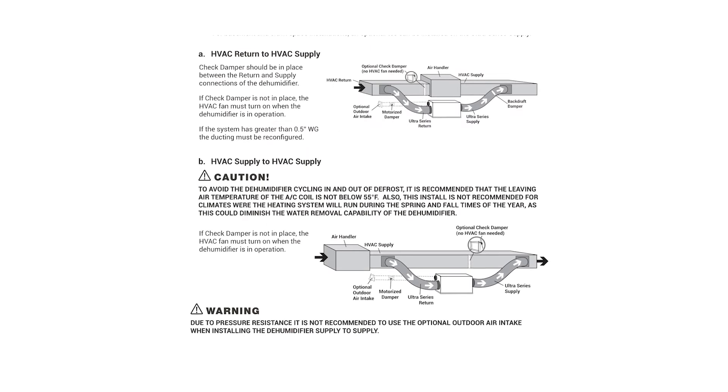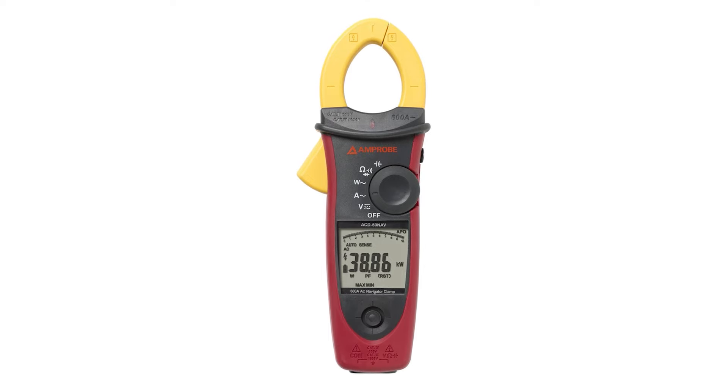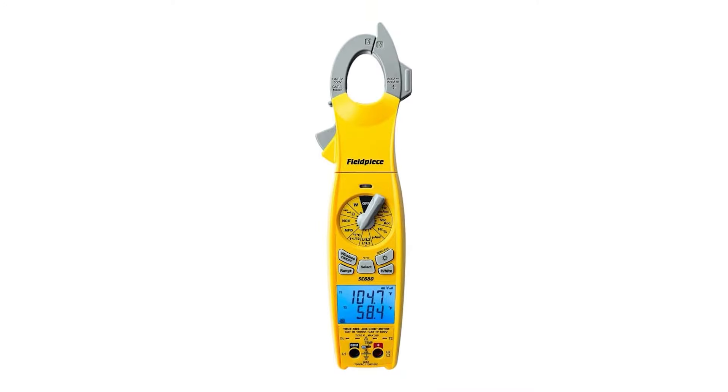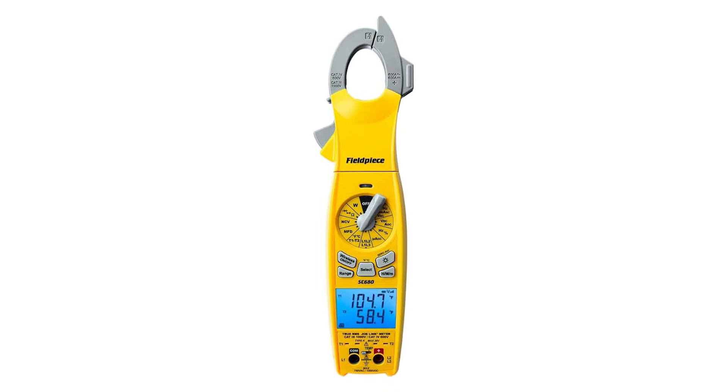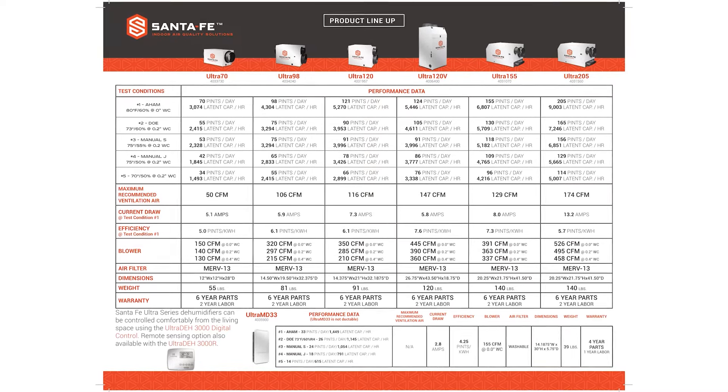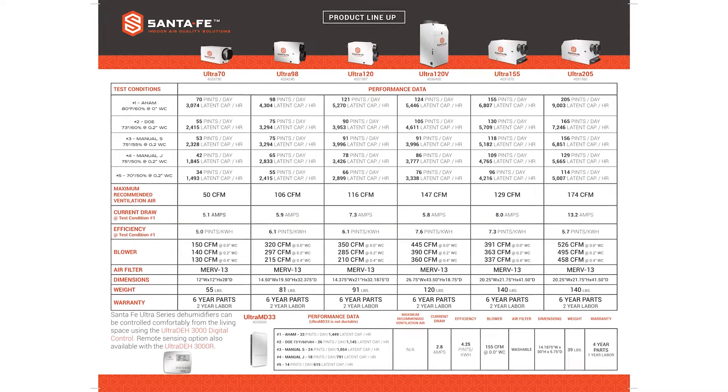The basics: you've got to know about your dehumidifier. Open up the manual, look at the performance charts. Entering air conditions matter a lot if you're going to figure out whether it's performing properly. You're also going to need to know something about power consumption, using something like a wattmeter. A lot of these are plug-ins using around a kilowatt. My current favorite wattmeter on the market — because we've tested a lot of them — is the Navigator by Amprobe. They're not a sponsor, but it's a wattmeter I really like. Fieldpiece also makes a wattmeter that's going to do a good job. But you're going to have to go back to that particular manufacturer to determine whether it's performing how it's supposed to.